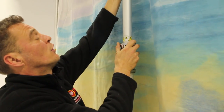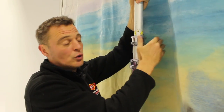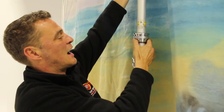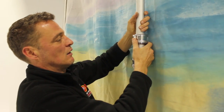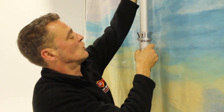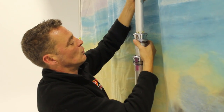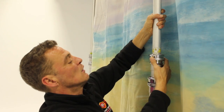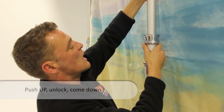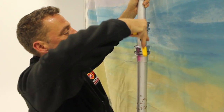When pushing up the first pole — this is first and this is second — the yellow mark means you've gone too far. You don't want to go there because the thing will pop out and fall. Bring it down past that level. To make it come down: as you can see it'll go up but it won't come down — so you push up, unlock, come down. If it won't unlock, that's when you need to get the pliers out and push the ball bearing.